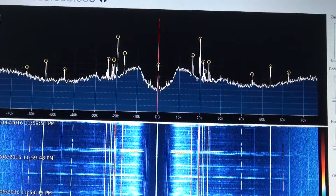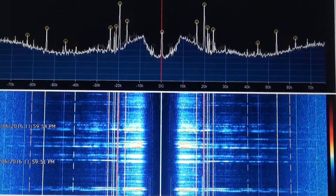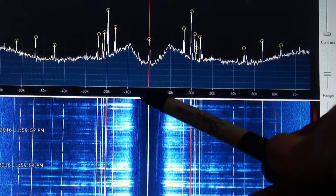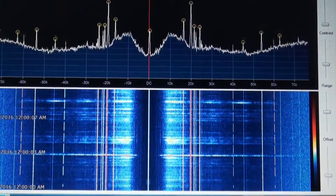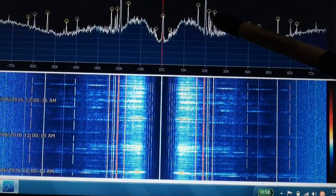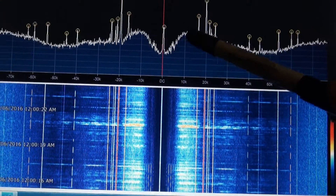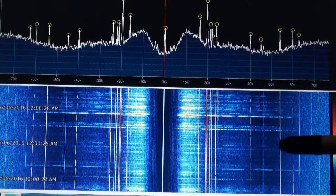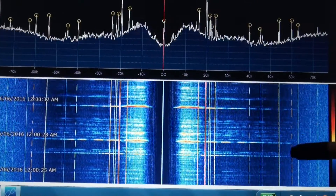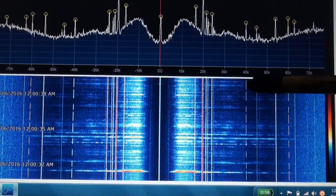The sound card is 192 kilohertz, and consequently this program will show about half of that — about 80 kilohertz of spectrum — from DC to the end of the screen, mirroring the same thing on the other side. Immediately you can see the noise floor is a lot higher, so it's obviously more sensitive, but the signals are all sticking up quite dramatically. Straight away you can see at 60 kilohertz the Japanese time signal — couldn't see that at all with the SDR play.